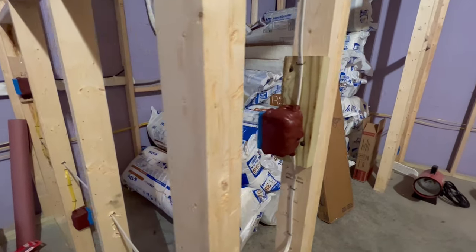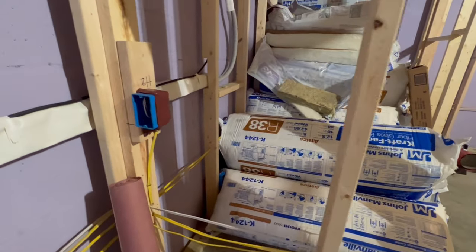The walls and ceiling structure are the same. Now you're probably wondering about outlets, light fixtures, and ceiling lights — how do those things penetrate through? In any soundproofing situation like this, you'll need to run your electrical through the drywall with the smallest hole possible. Ideally, run the wires through a single hole and surface-mount any electrical outlets, plugs, light switches, or lights — that's the best option, and what professional studios do. If you want to cut out space for flush-mounted electrical boxes or lights, you'll still want to use putty pads around the back of outlets and fixtures to make sure it's airtight.